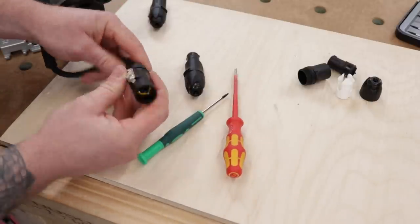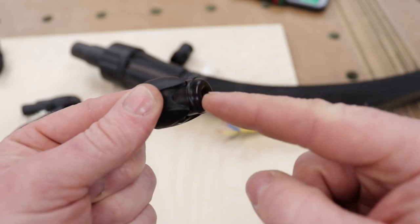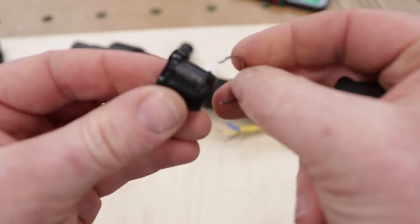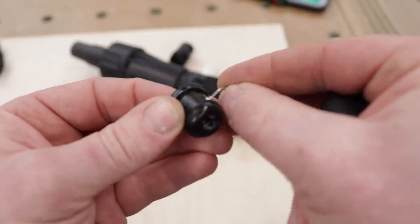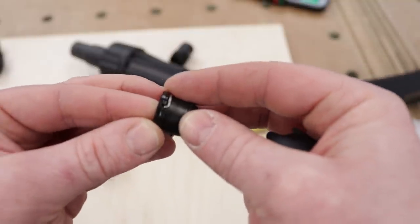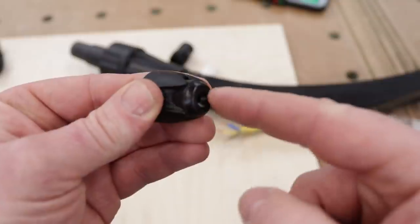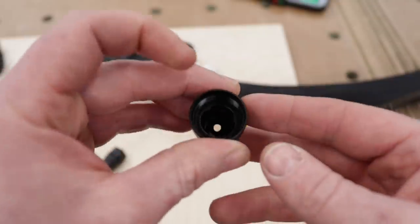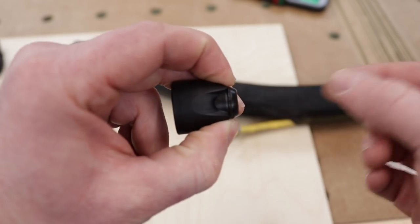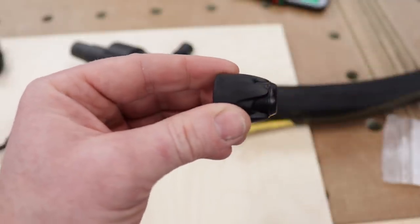Don't worry if you think you can't get it apart once assembled - you actually can. There's a little arrow where a small metal pin protrudes. If you want to reopen this and redo connections or change the plug, just push that pin up and it will untwist - it locks the outer ring in place, which is a nice feature. That's the plug made off. For the socket: be aware that if your cable is slightly large you can push out the grommet and it pops out. There's a little clip on the end - don't lose it. It has a hook end, rotate around and there's a little notch it sits back into.